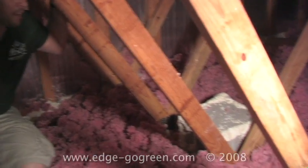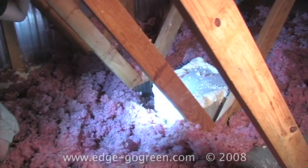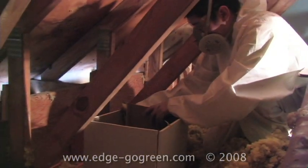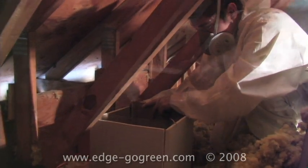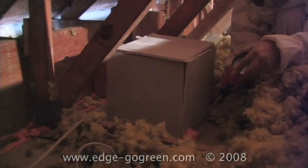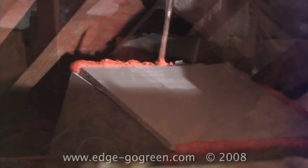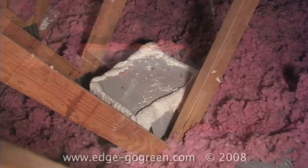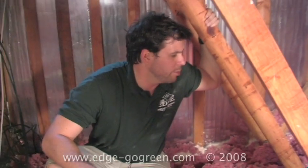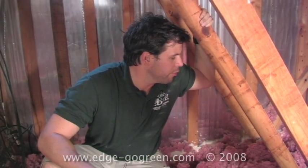To my left over here we have a different type of recessed can light, and the retrofit that we call this is an AT box, for airtight box. This recessed can light was a halogen style fixture, and per building code you must have at least 3 inches of void space, dead space, around such a hot fixture to the nearest building material. So instead of installing those plastic covers as you saw on the other side of the house for the insulation contact rated light, for non-IC lights we built a little airtight box out of drywall and spray foam, so you've got a little sealed compartment that won't let any air infiltrate or exfiltrate from the building shell.